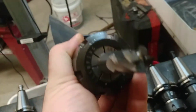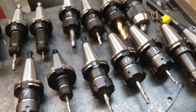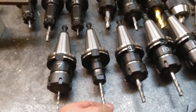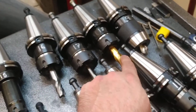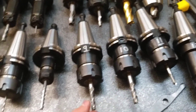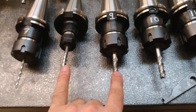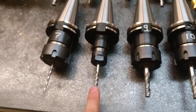I don't think I'll go much bigger than this. There's one for steel, but I've really not milled any steel with this machine much at all, and it was pretty horrible when I did — partly because all I had that was useful for steel was high speed steel. All my carbide end mills were three-flute, made for aluminum.